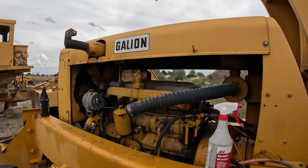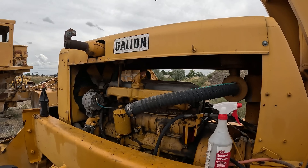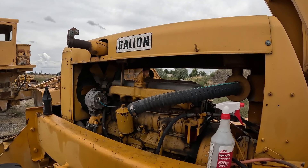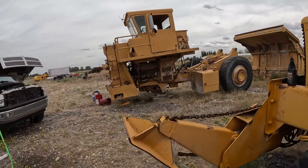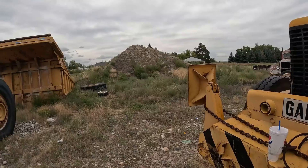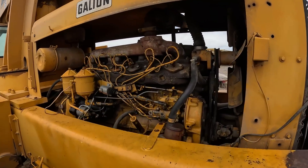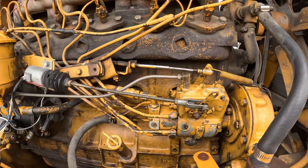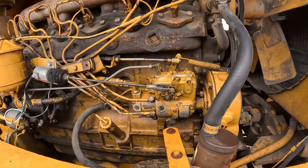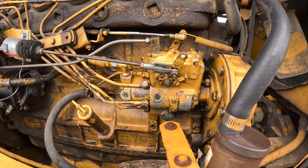All I can say is probably got a check valve leak, and just the sheer pressure of the vane pump pushing some through - but the plungers are not working. At this point I'm just gonna give up. I hate doing that, but I think this one's worst case scenario, and probably more than likely those plungers are stuck bad. They're spinning at that many RPM and putting quite a bit of pressure to it, and it didn't loosen them up - I don't know what will.